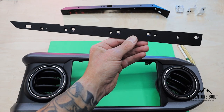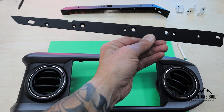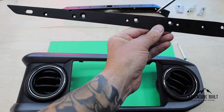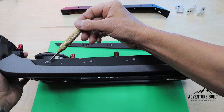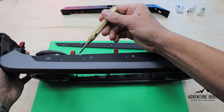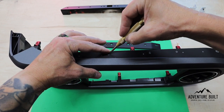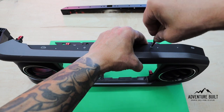There are a lot of holes on this base plate, but let me point out the ones that actually matter for our application: holes one through five. The smaller threaded holes on the back are for a standalone plate we don't have for this application. As it translates to the bezel: slotted hole, large hole, large hole, large hole, slotted hole — and where the wiring harness pops through. Before drilling, center punch every hole. Hold the bezel firmly and center punch each of the five main holes.